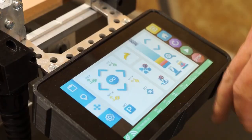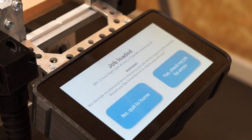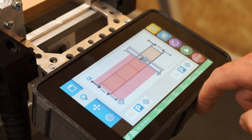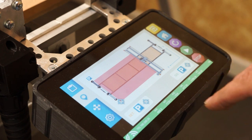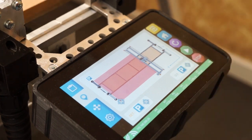If you'd like to see a full rundown, please follow the link in the description below. Let's get to cutting. So once I've loaded the file, I will let the SmartBench check all the G-code for any errors. That will ensure that my job is within the parameters of the machine movements. Then I will go to the map screen, and when I'm at the map screen, I'm looking to double check that my home location is in the correct position. It will show me the size of my work piece, so I can make sure that's orientated correctly on the bench to the X and Y, and also to make sure that it replicates roughly what I'm expecting.